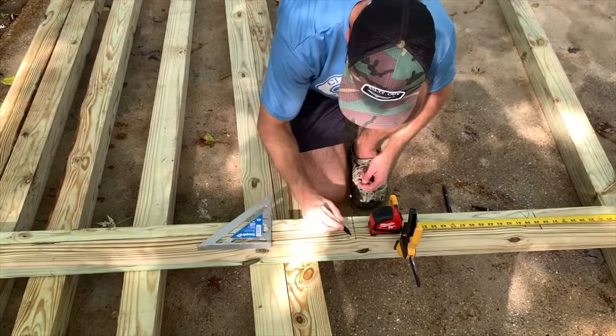So at this point, we have our first 2 panels installed. One panel has the window cut out, and now we need to install the partial panel towards the back. As you can see, this is gonna be a 2-foot wide segment, and because these are 4-foot by 8-foot panels, that means we're gonna need to cut one of these panels in half lengthwise.